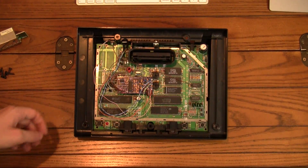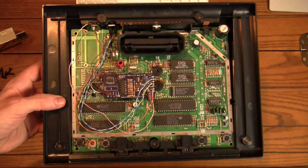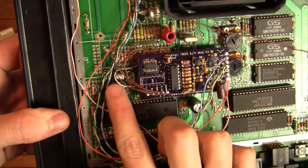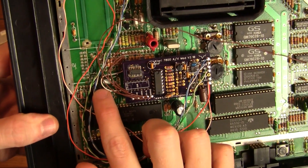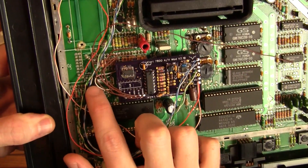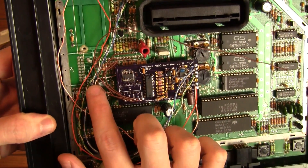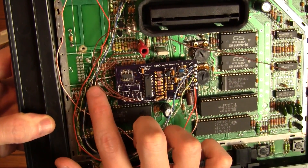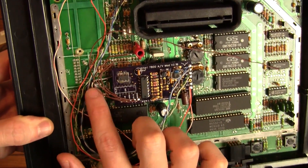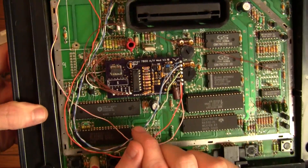And we're back on day two. I've replaced our capacitor here. This looks a little bit different than the one that was in there — it's a lot larger and made of different material, but that's no problem because it's rated the same. Also, this little wire that you see here is replacing the trace that I accidentally ripped up. Again, be patient — don't do that like I did.